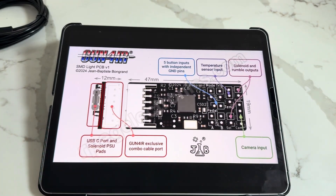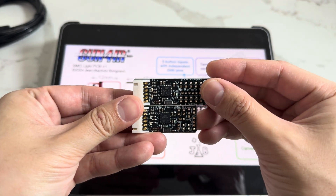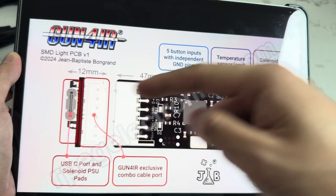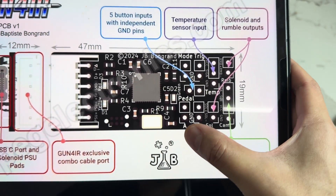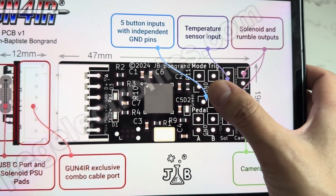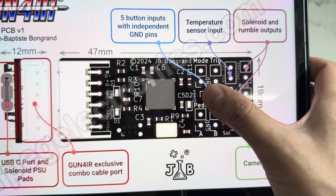Now let's move on to the light PCB — a little smaller, saving about almost an inch. To trade off for that inch, we're not giving up much. It has the exact same port and the same USB-C on the back for breaking out. We have five buttons: A, B, trigger, mode, and a pedal. The pedal button I like to assign to X or Escape, but you can use it for a start or select button. The mode button is not an input — it's for triggering four-to-three aspect ratio mode, calibration, and things of that sort.